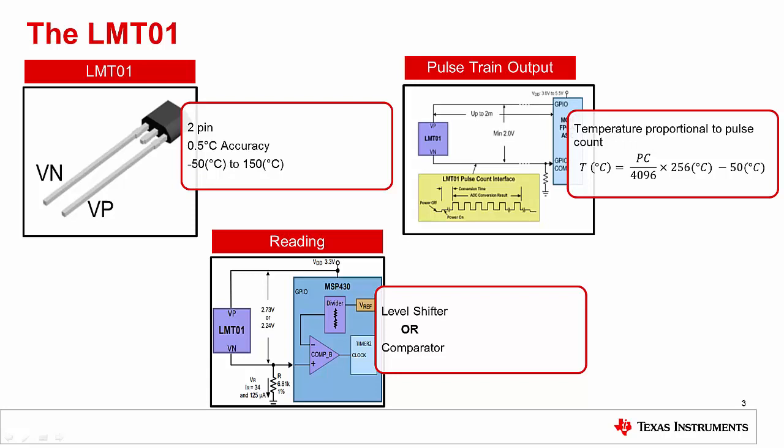The layout for the demonstration today will be similar to the images shown on this slide. We will connect a 5 volt pin on the Arduino to VP on the LMT01, and pin A1 will be connected to pin VN, which will have roughly 13.4 kilo ohms of resistance leading to ground. This value was selected because it will create an output voltage between 0.46 and 1.68 volts when the output of the LMT01 is low or high respectively — sufficiently above and below our reference voltage of 1.1 volts. The typical low current of the LMT01 is 34 microamps and the typical high current is 125 microamps. Values between 12k and 16k should work for this setup. You can also use an external reference voltage instead of the Arduino Uno's internal 1.1 volt reference voltage, which would also change the value of the resistor needed.